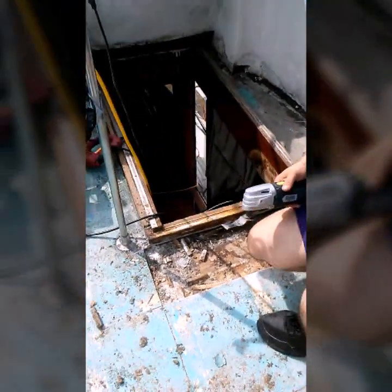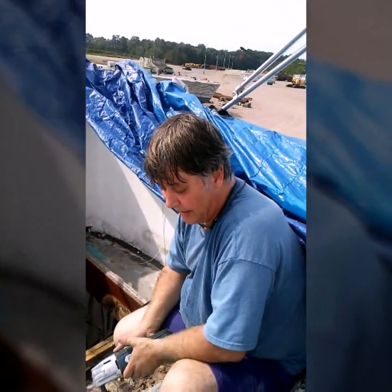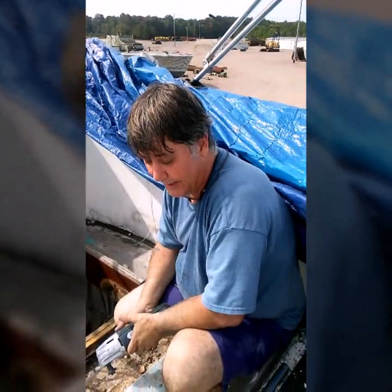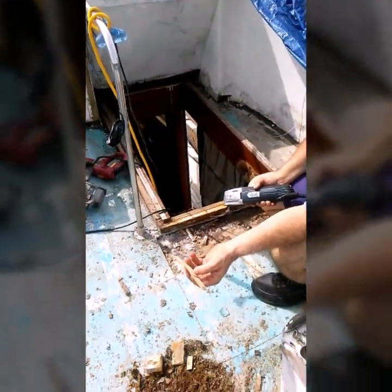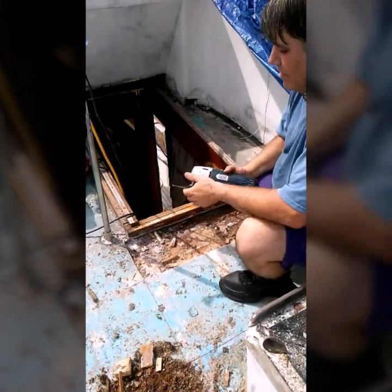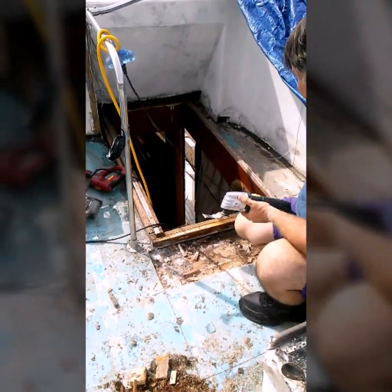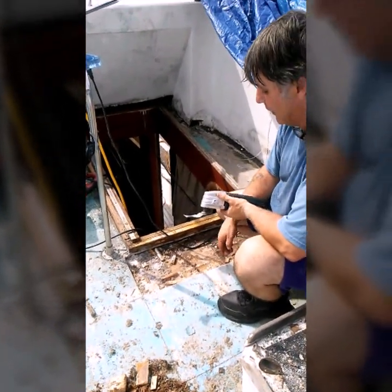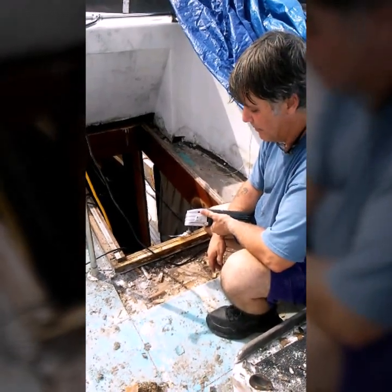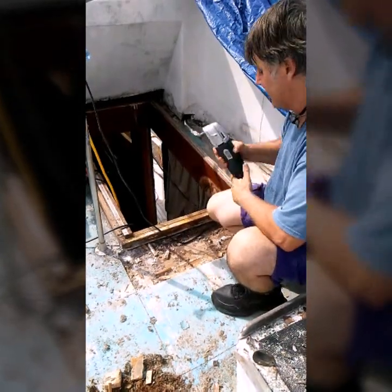You have different varying tones in between depending on what it's made out of. This is a balsa core deck. You can see the balsa wood here that comes out. I took a regular circular saw, cut a pattern back into areas that are affected. I cut it back about an extra foot in case I needed to pull that piece up too. I actually only ran into a few inches of rotten area — about six inches.